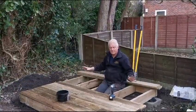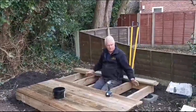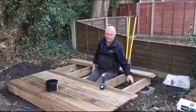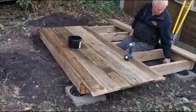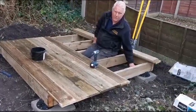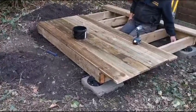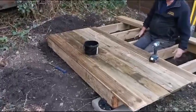This is a shed that I'm building. Very important with the actual shed base — I'm using 6x2 timbers on this. I've installed concrete feet for these, so these are concrete pads that I've made and they've got rebar in them for added stability and strength.